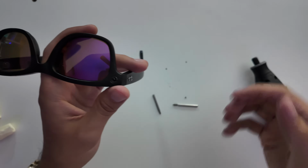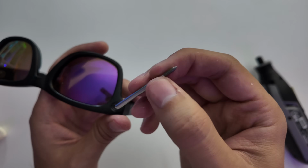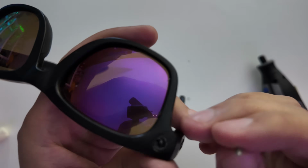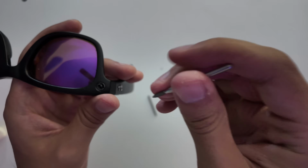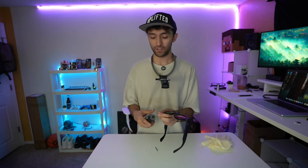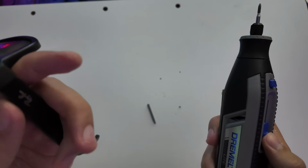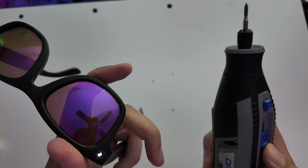No, but what we're actually gonna do is just use the normal diamond head bit, get a little closer to the middle of the circle, which means we're gonna need to break the rest of this glass. And then we're just gonna do it very, very carefully with a lower amount of pressure. Probably gonna keep it on 2 and not escalate to 4 this time. Let's put it back in, rotate it. Just gonna record again so that I know.